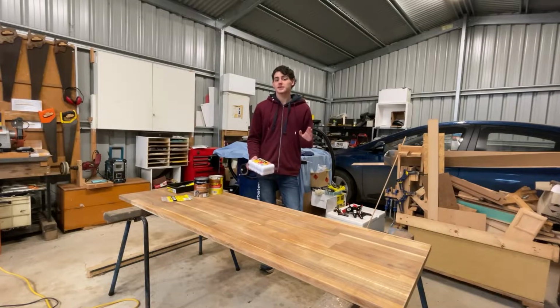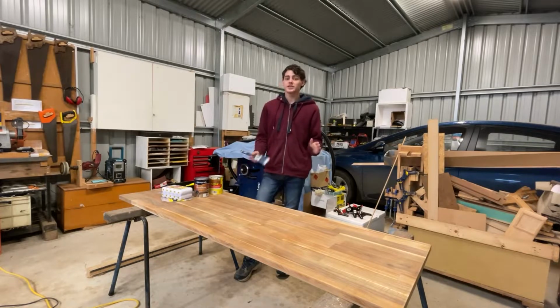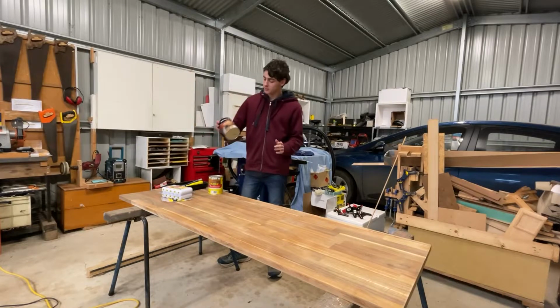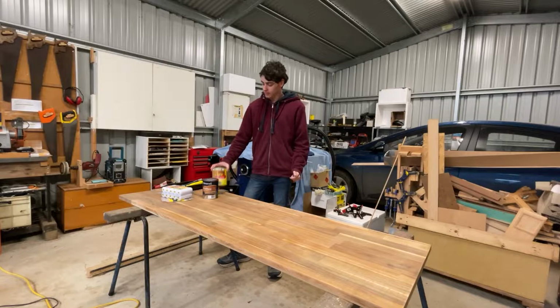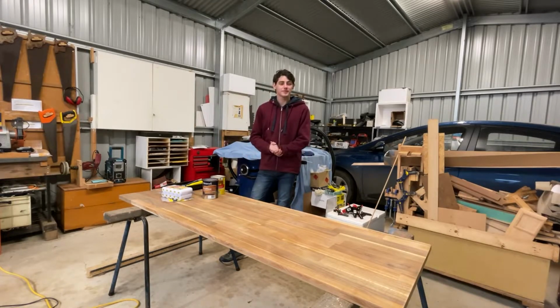Now for gloss and satin finishes, you want to use a foam roller. This just helps smooth out anything, gives you a perfect finish. And for the edges, just pick yourself up a good quality brush. Now, since we are using water-based, we will only have to wash it up in water, which is just great, saves a lot of time, whereas oil-based, you will have to use turps. All right, with that out of the way, let's get into varnishing.